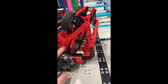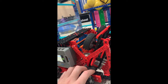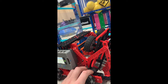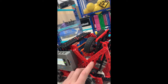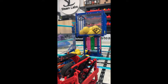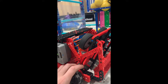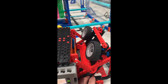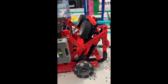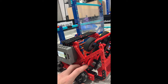Now we have our wheels on here and there's no motor on the back. If you have a look at how much this spins when we turn it around — this is why it's called a flywheel. This is allowing us to create a really, really powerful mechanism. When both of these gears are turning, it should allow the robot to shoot the ball into the basket up here. We're waiting for another couple of parts to arrive, including the bigger wheels, so we can have the correct whip between the two wheels to shoot our ball. But this is a very quick explanation as to how this mechanism works.